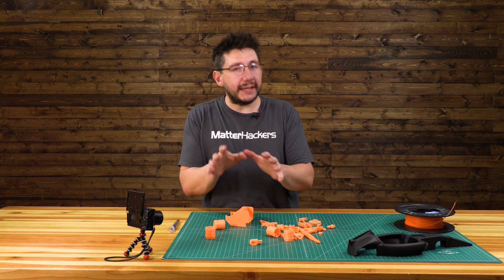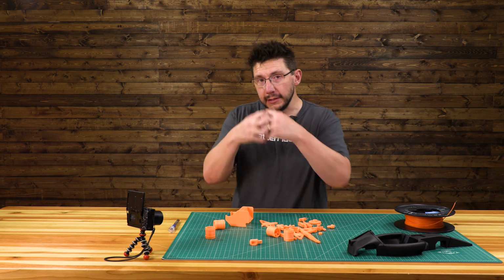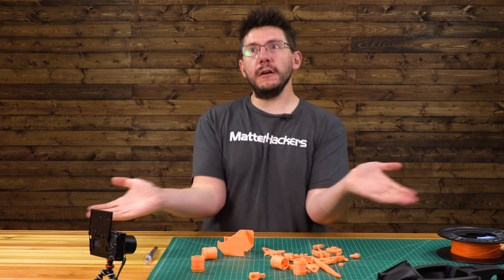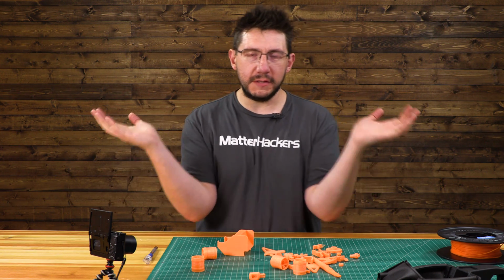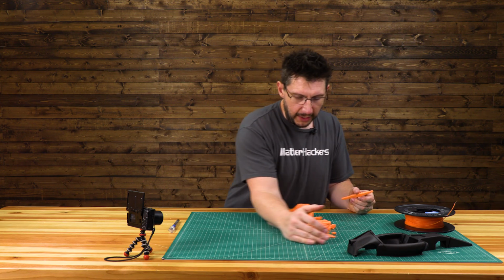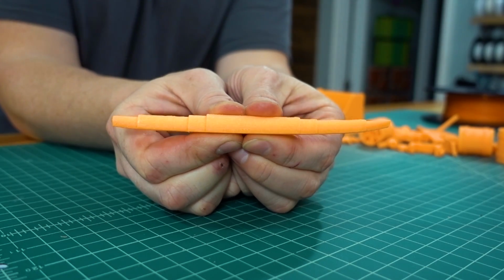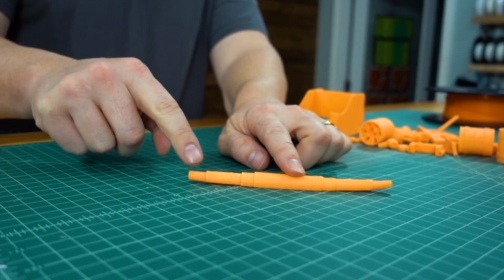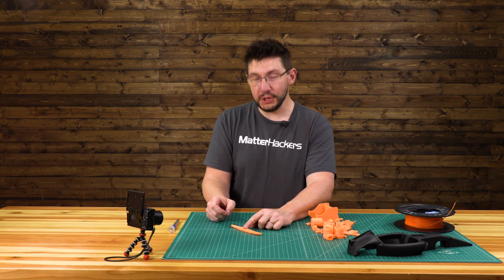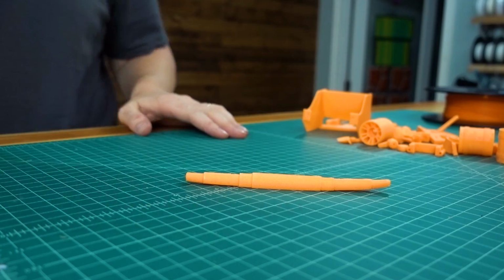I had an issue. The Pulse XE has a Garolite bed, and Garolite and nylon like to hold on to each other quite a bit. But nylon itself loves to curl up. It loves to give the top side a big giant hug. And so you end up with this. Oh, rear axle. Yeah, it's rather unfortunate. And so, brims.